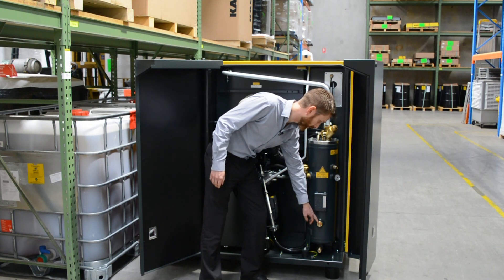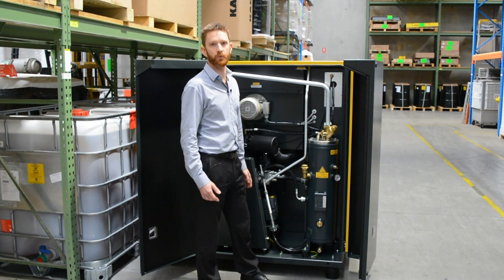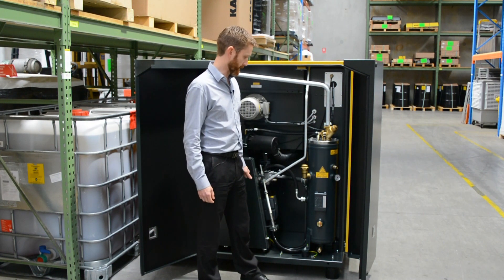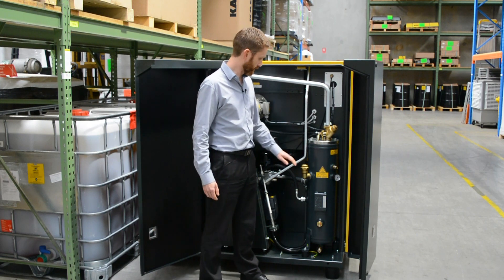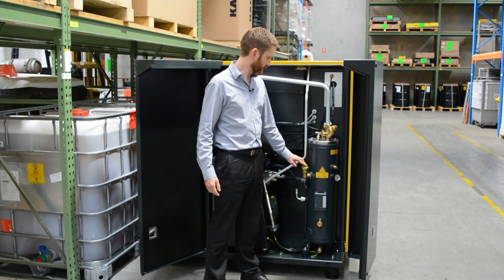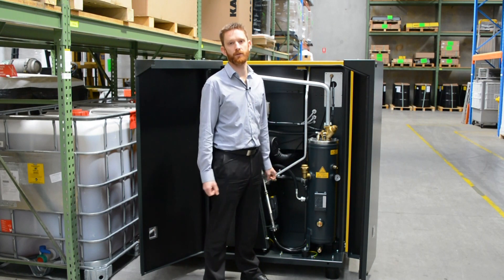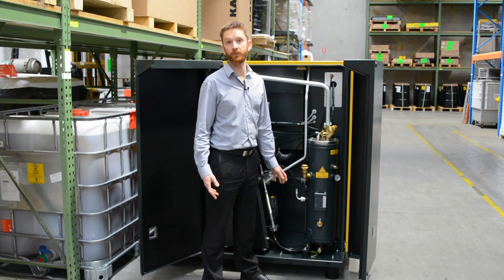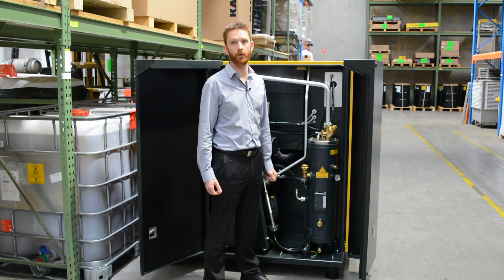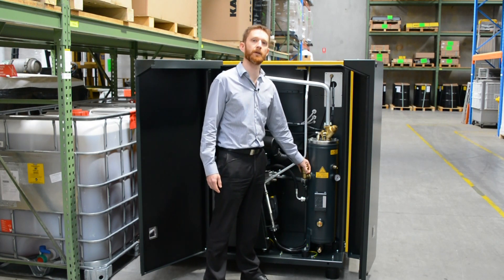This particular machine has a rotating dial that shows 'high' when stationary, which is fine. When it's running it would go into the green section. You can top up the oil directly into the separator, but it's very important to use the same oil that's already in the compressor — mixing oils can be quite detrimental. Consult your service provider before adding oil to the compressor.